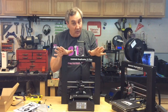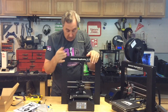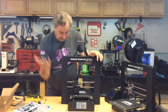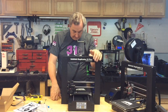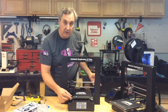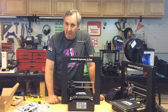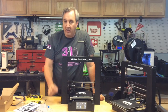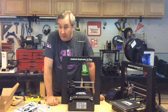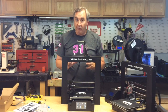I honestly have no idea what happened. I checked everything — I couldn't see any shorts or anything wrong. I powered it off, turned it back on, the LCD came on, it still homes itself, and everything looks fine. I was able to adjust every corner. I touch it now and it's cold. You can see smoke come off this corner in the film and it was definitely an electrical smell — something burned. I shut it off right away; maybe I prevented it from burning up.